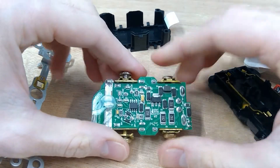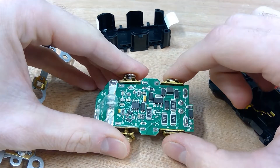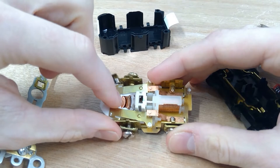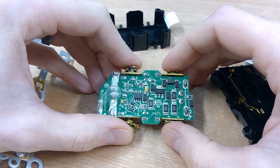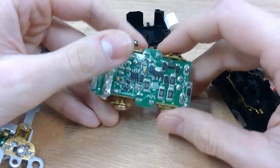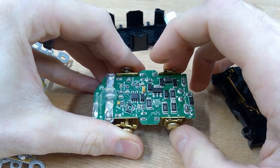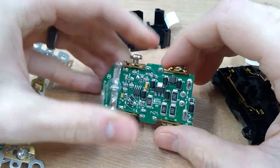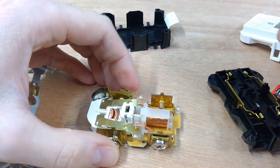The coils are sensed on the bottom side of the board, and they're going to this chip called an operational amplifier. An amplifier takes the two voltage quantities coming from these two coils, compares those, and if they are equal it allows current to pass through the rest of the circuit as normal. If they are not equal — that's why they call it a comparator, an op-amp is a comparison circuit — it will cause it to trip, much like pressing the test button manually simply simulates that.